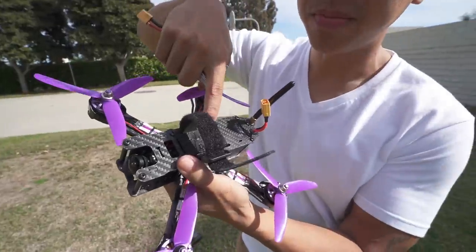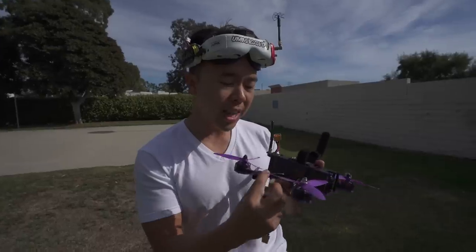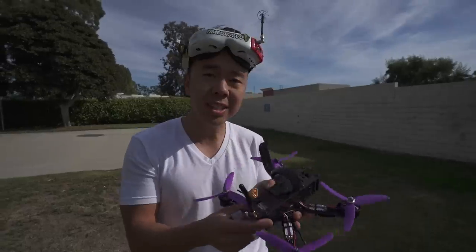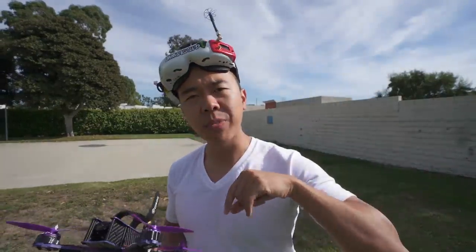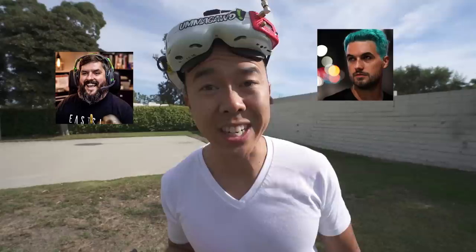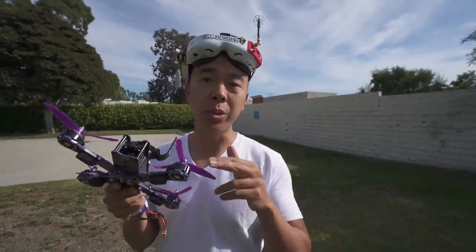Quick recap of everything done: Umma Grip for a battery pad so it doesn't slip; receiver mounted inside with double-sided sticky tape so it's not using the battery strap; antennas relocated outside away from the carbon fiber; converted from PPM to iBus; new Rotor Riot Predator Mini camera. In Betaflight: Air Mode turned on, Motor Stop turned off. Stay tuned for episode two — someone from the crew picks this up from where I left off. Parts are available at store.rotorriot.com. Hit like and subscribe!